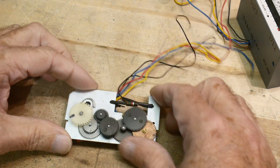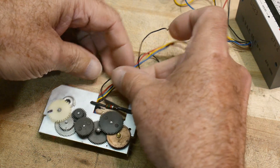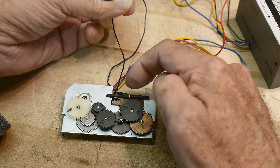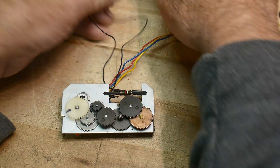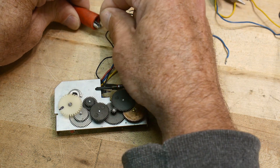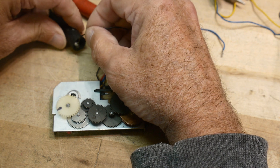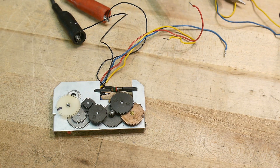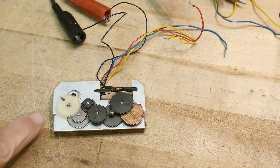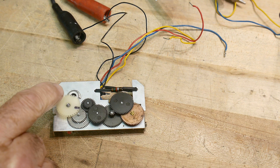What's really cool is this little black mark here is not original — I put that on there so we can watch the wheel go round and round. The two black wires run the motor and they run through a 5.6k resistor. We can hook them up here — here's 120 volts. Don't you have 120 volts just laying on your bench? Let me turn on the safety switch. And let me turn it on. There it goes. Now you can see it's not going around smoothly — it's kind of going in jerks. There's an actual Geneva escape mechanism in this thing.